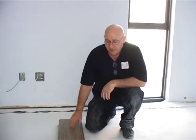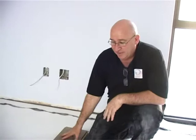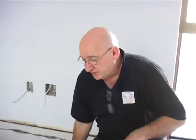Products coming in. This is a click system installation, like we said. It's a laminate one, not an engineered. The same rules apply to laminate and engineered. What we're saying is when it's click, right? With this installation, the longest you can go is 10 meters, and the widest you can go is 8 meters. So 10 by 8. Anything over 10 needs an expansion joint on the length, and anything over 8 on the width needs an expansion joint.